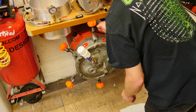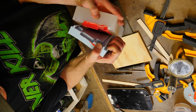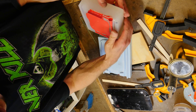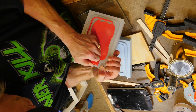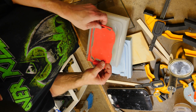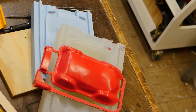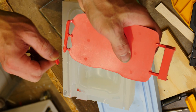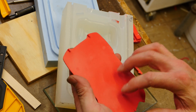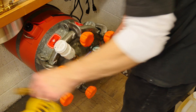Easy again to undo the knobs since they're so easy to grab onto. Let's take that out of the tank and see how our part came out. This is what I would call a gravity mold — you can see the sprue and the runner. The resin goes through the gate at the bottom of the part, fills up the part, and then comes out the little runners at the top into the overflow area. You get a really nice part this way with minimal cleanup. There should not be any bubbles inside this pressure-cast part. You just snap the waste material off — it looks like a little plastic model part, because basically that's what it is.